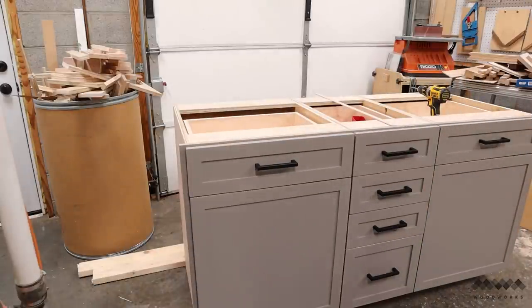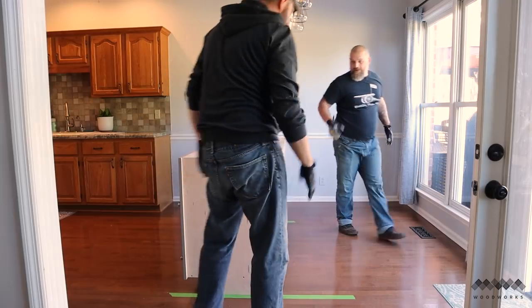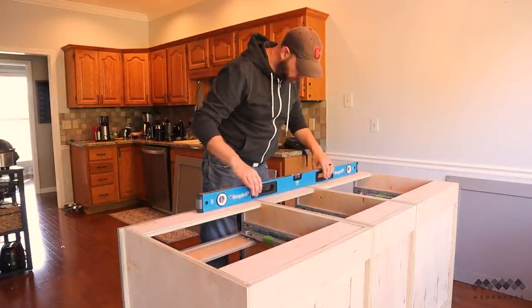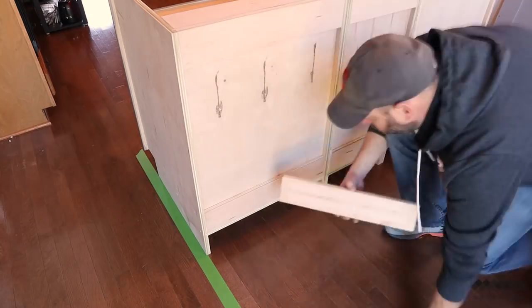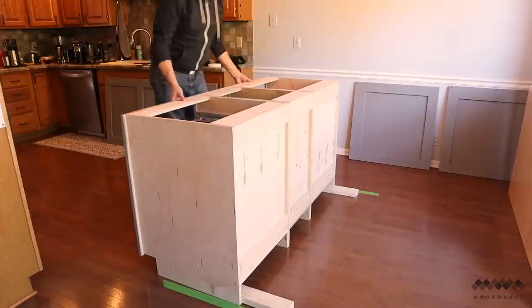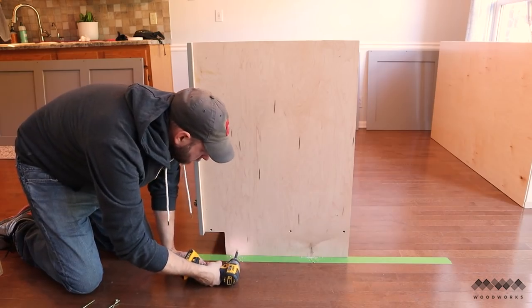To begin the install, I get some help from my neighbor — he likes to lift heavy things and put them down, and for that I am forever grateful. Once the cabinets were in place, I quickly checked everything for level, and somehow this part of my kitchen floor was completely level. No shims were needed. Now that the cabinets were exactly where I wanted them, I added cleats using double-sided tape to place the cleats under the cabinets. The tape keeps them from moving as I move the cabinets out of the way, giving me room to secure the cleats to the floor with three inch screws. Then I moved the cabinets back over the cleats and fastened the cabinets to the cleats from the sides.